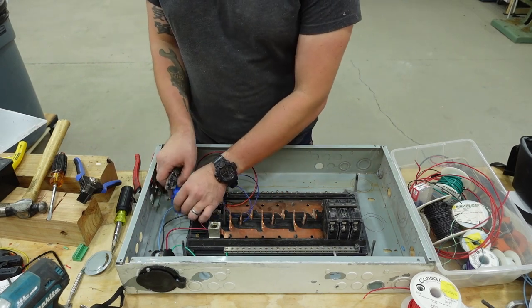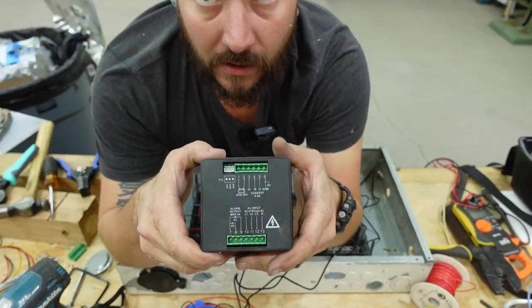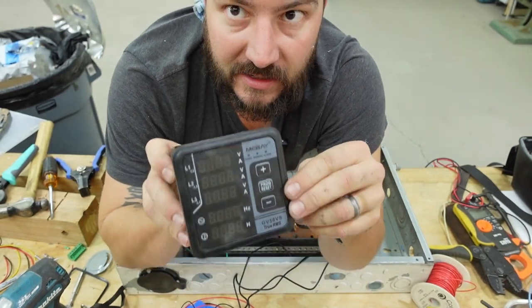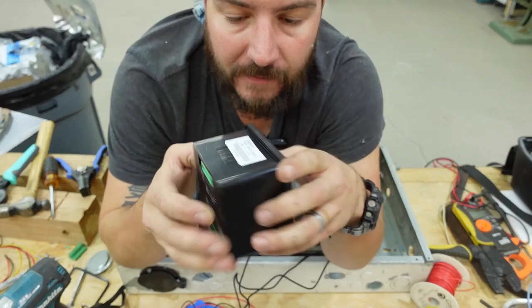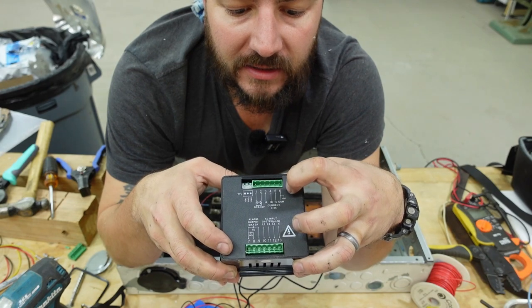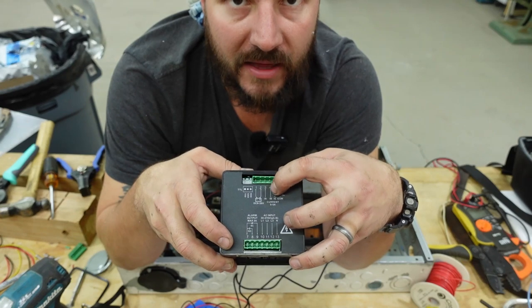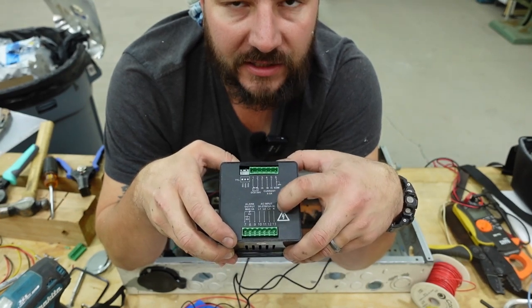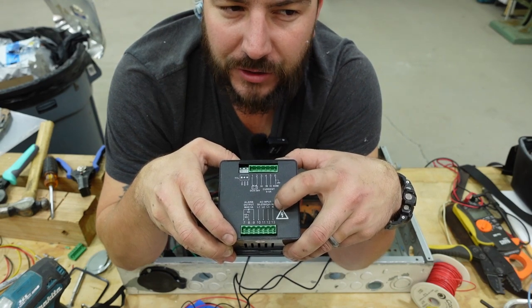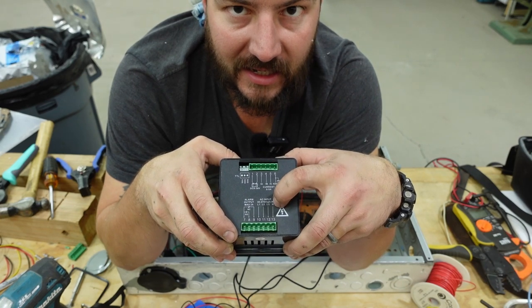and report the current that's passing through them. Hey, all right, check this out. This is the three phase monitor from the magical internet. So it takes the current clamps, the current transformers. So we got common and then one for each phase. And then it takes the voltage input. I don't have a neutral, and I hope this isn't ground. I'm just going to not connect that.